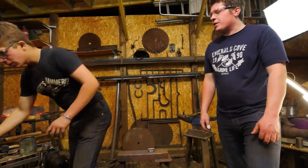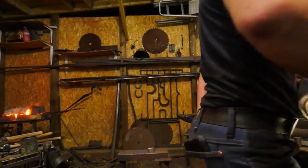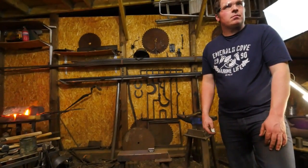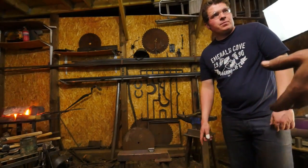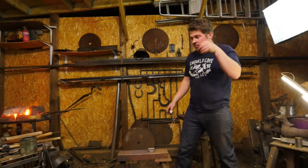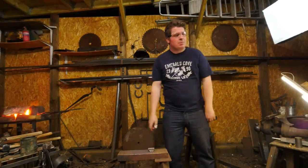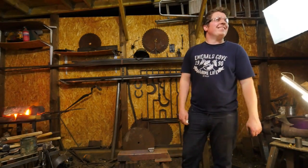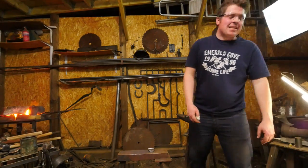Best steel for making chisels? It depends if it's woodworking. There are so many different steels you can use for making chisels. Saying one is the best is impossible. A great steel for making chisels, whether it's woodworking or steelworking, is the same steel that they make car springs out of: 5160. Go down the scrapyard or find a local farrier and hack off the coil springs from his truck. Mine's on leaf springs.